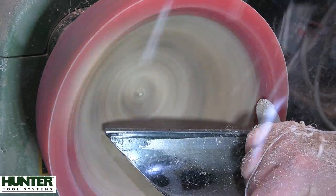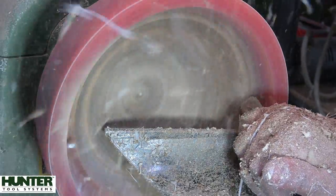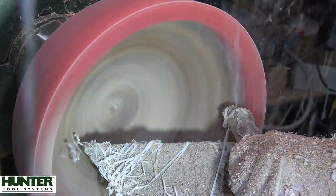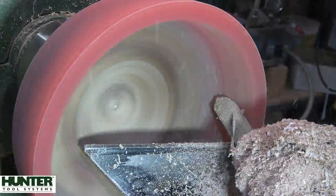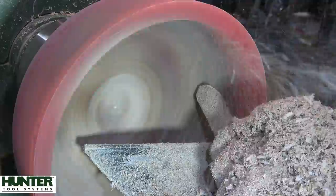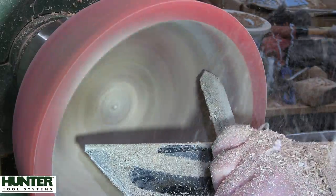And I've said this before, and I'll say it again, typically I want my resin casted bowls to be 3/8 to a half inch in thickness. That's what I'm shooting for. If you go really thin on these pieces, the less bonding surface you have for that resin, the more likelihood you're going to have issues. So that's why I really don't like to see my castings any thinner than 3/8 to a half inch. By all means, you can share your thoughts on that.